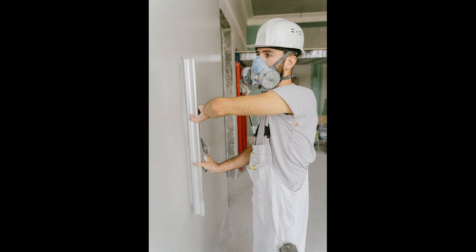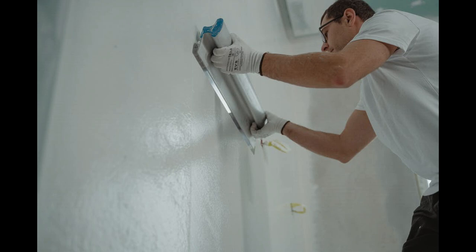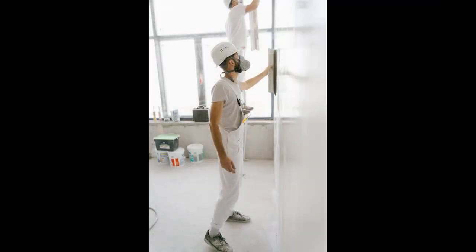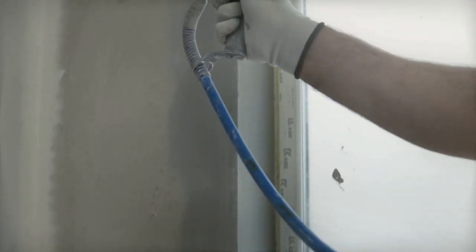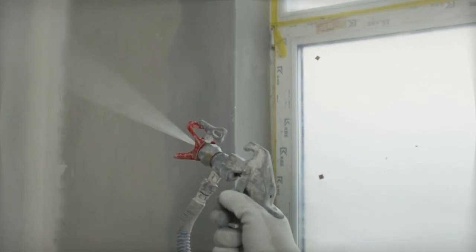On outside corners, apply paper-faced corner bead by applying cover coat compound generously to the adjoining edges of the concrete column, about 3 to 4 inches on each side along the length of the column. If a corner bead is required, align and set the paper-faced metal corner bead into the freshly applied cover coat compound and wipe down the flange. Let the compound dry, then apply successive coats, feathering out slightly beyond each coat until the flanges are filled and smoothed. Let each coat dry before the next application. Apply sufficient coats to make the column surface smooth and level.